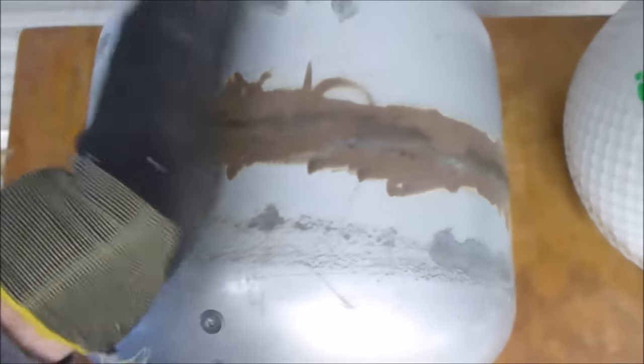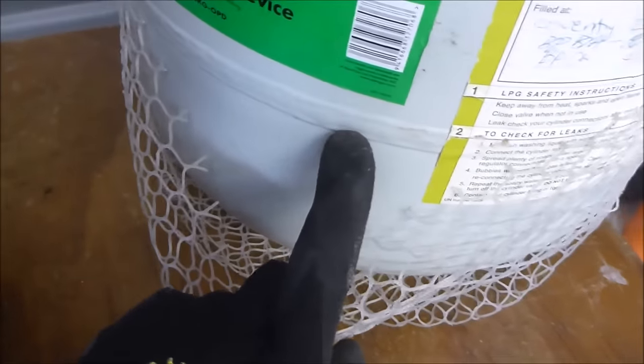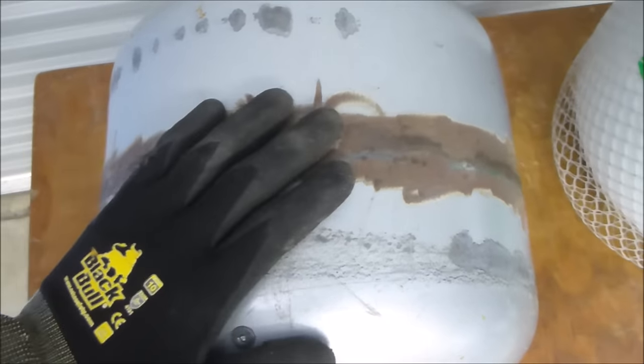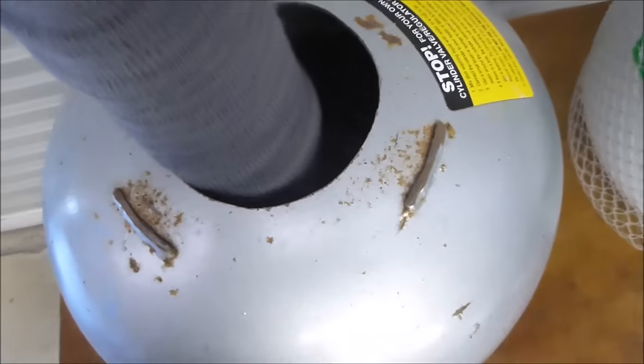The last thing on the outside: because we're running on two flat rollers, the whole thing didn't work that well since these gas bottles are made with a welded seam — that's a high point where the top and bottom halves are welded together. So I just took the grinder with a grinding disc and spent 10 or 15 minutes grinding that relatively flat. That hasn't seemed to cause any problems — the welds obviously penetrate enough that you're not actually causing any structural issues, and there's not much pressure in there anyway.